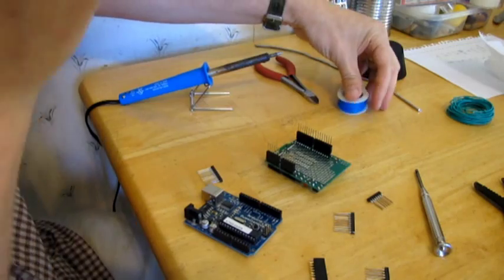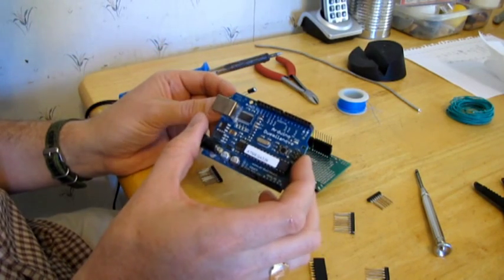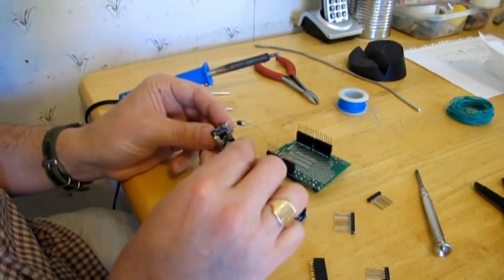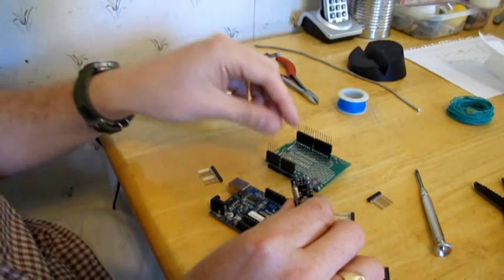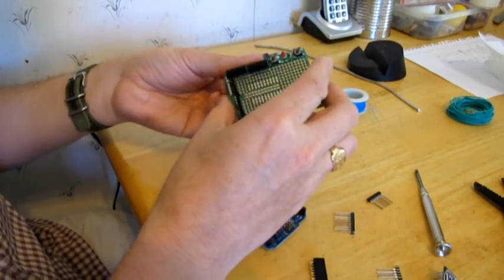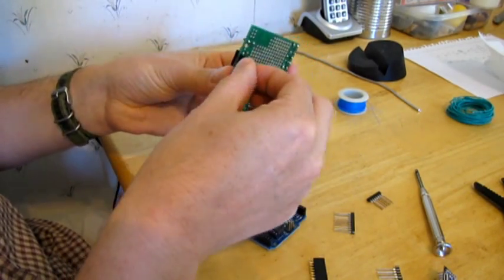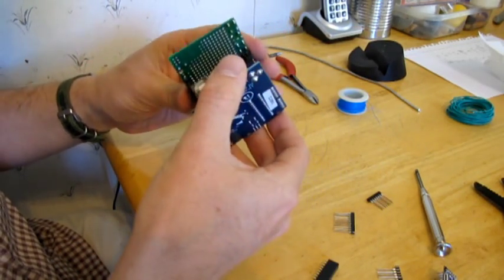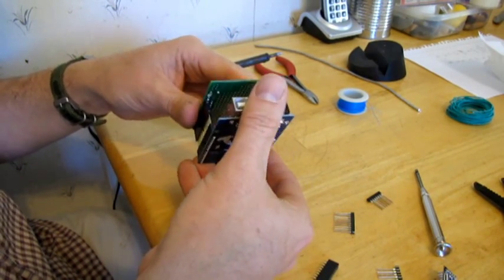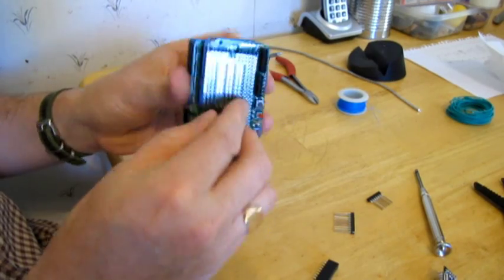And that's what I'm going to do today. I have this NRF radio, and I've got it integrated with a Duemilanove Arduino. I just wanted to build this up as a bit of a kit so that I could test it out with my DigiX. Now I've got a Lady Ada Proto Shield, which I got many years ago. To get the extra clearance for the wire wrap, I've got this extension thing, which I got for another kit sometime. That gives me enough clearance once that's assembled that we don't have any problem with the little legs for the wire wrap. So there we go.